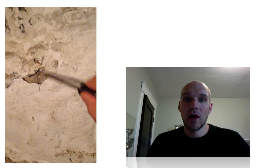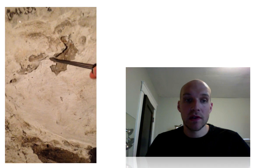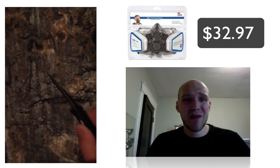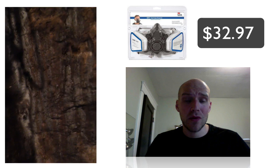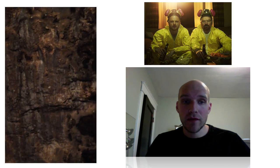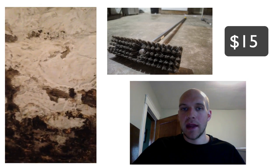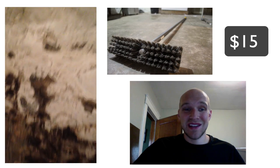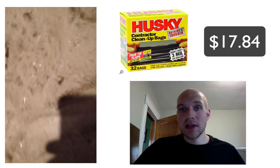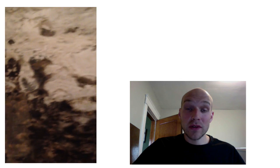You can see in the video that right now I'm picking off brittle pieces of the wall. Over the years the walls become very brittle, and the first step I took was to clean up the wall of loose debris. You definitely need a respirator — this stuff is not healthy to be around. Make sure your basement is closed off; don't have your furnace running or anything that's going to circulate air through your house. Have long sleeves, pants on, stuff that you can throw out — I just threw out the entire outfit. I bought a six-foot wire brush and used that instead of a handheld one because I wanted more distance between myself and the wall. I just really scrubbed the heck out of the wall and took out all the loose pieces. I didn't care if I was losing pieces of the wall; I just wanted to get rid of the stuff that was brittle and nasty. It probably took me about three or four hours to do all that.